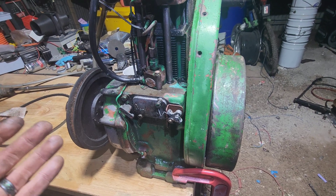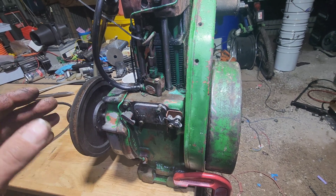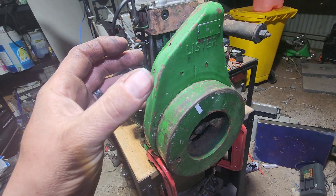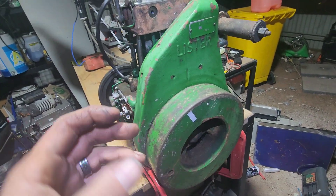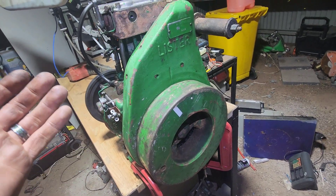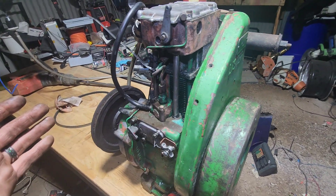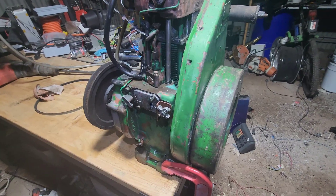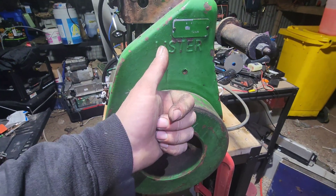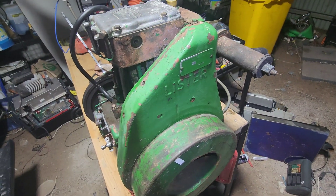We can fire this up for a few hours, run 10 liters through it — it should run for about 8 to 10 hours on 10 liters. At the 3 to 4 horsepower rating it's about 800 mils an hour, so it's quite efficient. Long stroke, smaller bore — a lot like a diesel truck engine. They're quite efficient on fuel, don't get hot, and are made to run in continuous ambient temperatures up to 52 degrees, per Lister's claim. We ran it for about 15 minutes with the thermal camera — everything looks fine, no hot spots on the bore. Should be a great little charging system. Thanks for watching!